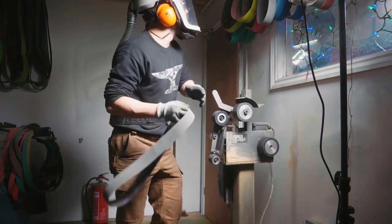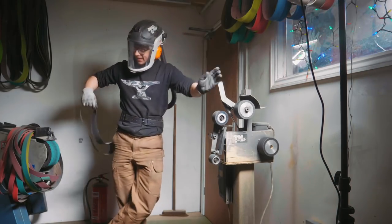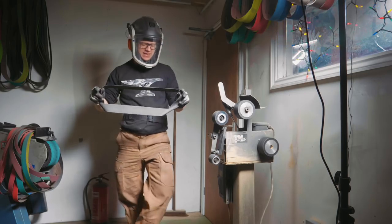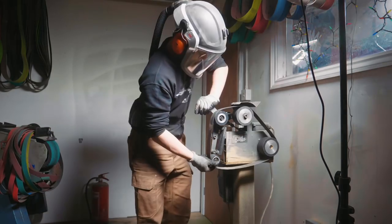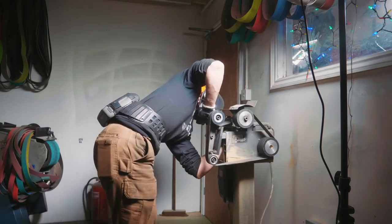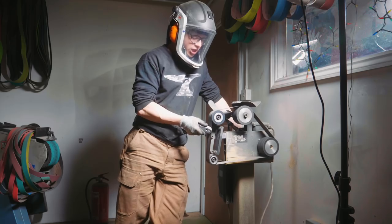So I've done the 800 grit. That little secondary bevel is looking fantastic. And now what I'm gonna do, I find this so funny, but it seemed to work on the Katana really lovely. Turn a belt inside out, put the belt on the grinder, get a good bit of tension. I'm gonna turn the speed way down and then take some polishing compound and charge the belt.